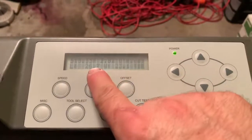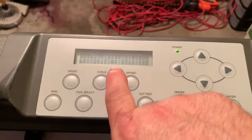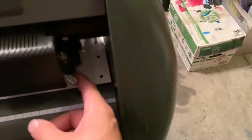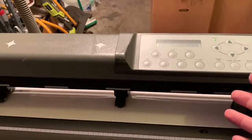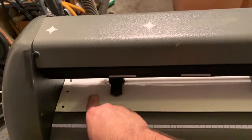Make sure that the crop marks are within the cutting area — they need to be to the right of the left wheel and to the left of the right wheel. When the machine goes to read the crop marks it needs them within the area where it's cutting; it can't read them if they're outside that area. So when you print with the FJ50 the crop marks have to land inside where the machine cuts.